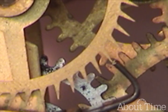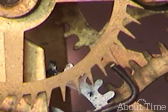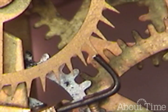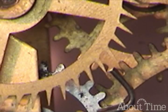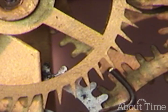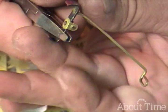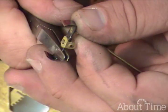I'll lift this up a little so that it is more straight on for you. And you just ever so slightly let it go. So it's looking like we've got minimal lock on the entrance pallet and quite a bit of drop on the entrance pallet. And that's what we adjust for first — the entrance drop. I'm going to hold it with a pair of pliers and we're going to close these pallets together to reduce the amount of entrance drop.